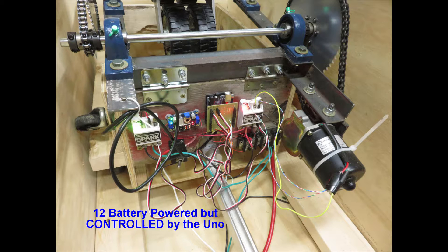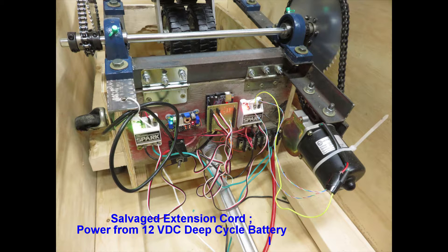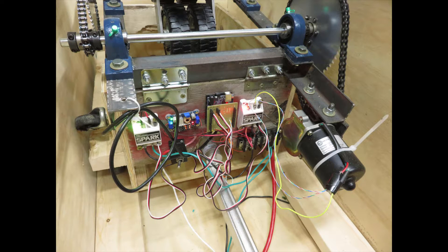I'm really liking what's happening. I'm not using the LM voltage converters anymore — I kind of like these external ones, a lot more efficient. One of the advantages of mounting everything to the cart is that I really only need one wire: this is the 12-volt wire coming from my battery. I didn't have to have a lot of flexible wires moving around, since this is controlled by a radio frequency switch.